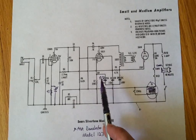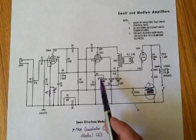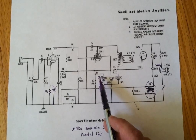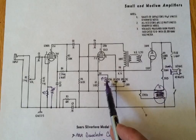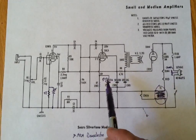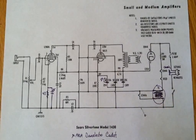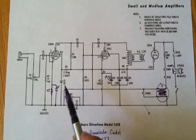One of the changes I made: I changed all the filter caps to new ones. This one is now a 50 microfarad, up from 30, which was the stock value. I did that to beef up the output just a little bit and give it a little more drive, and it did actually succeed in doing that, as we'll demonstrate.